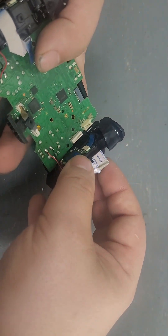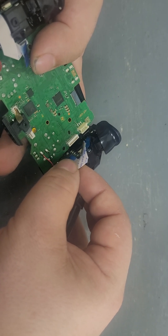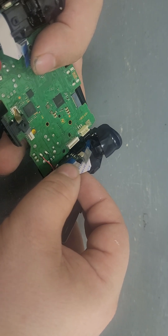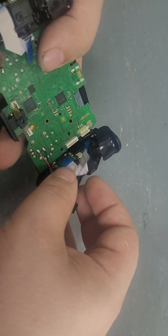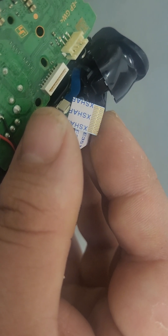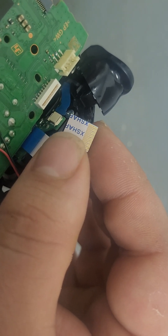You'll want to check these cables. The ones on the BDM 20s are a lot more durable; the ones on the BDM 10s are really fragile and they rip all the time. So if you have a BDM 10, there's a good chance there's a little tear in it somewhere. Make sure they aren't peeled up and that the contacts are clean.